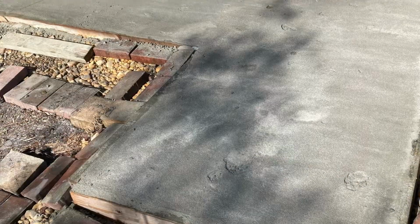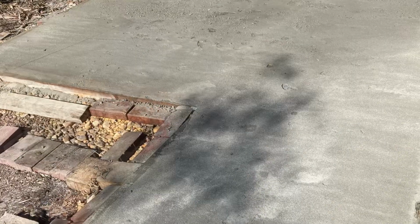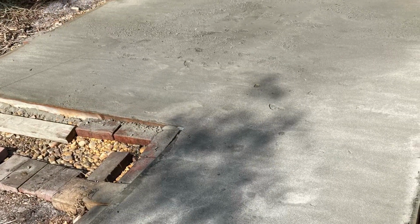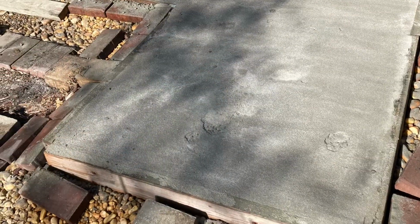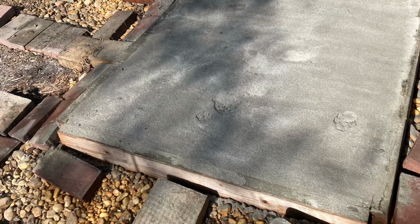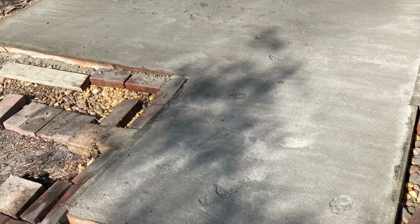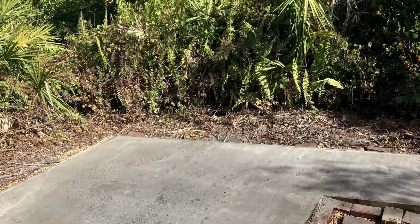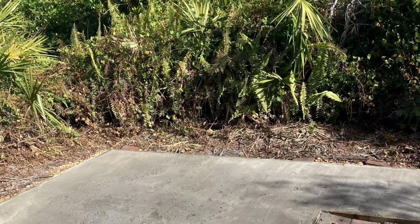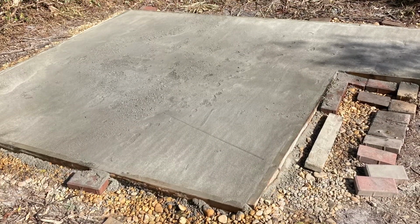Next, I used a weed sprayer and I misted the whole area and saturated it every hour times 3 the first day. The next day, I used buckets of water and saturated that several times. As you can see, there is some erosion. I wished I had used a Portland mix to fill in the surface holes because it's stickier, instead of the S mortar, which is 9 parts sand.